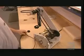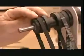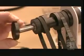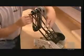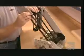At the arm shoulder level, they install a system of 4 pulleys. Each consists of 2 plastic wheels on a separate axle, with a rubber belt running between them like a clothesline. The belt has little teeth that grip grooves on the wheels. It rotates the wheels, making the robotic arm move.